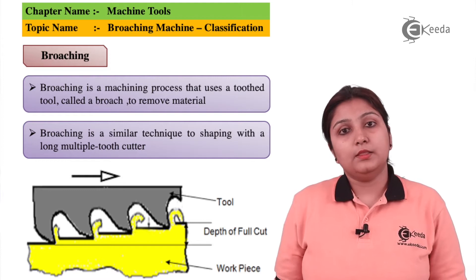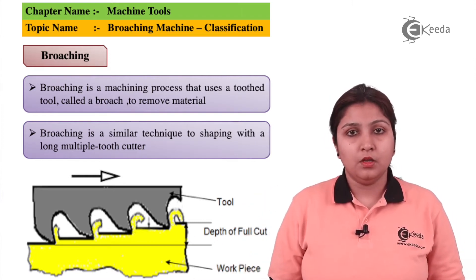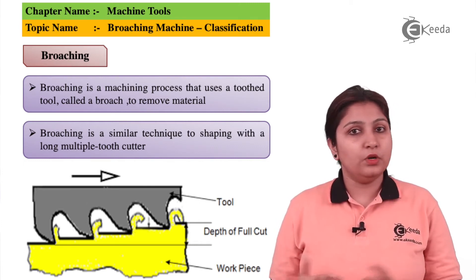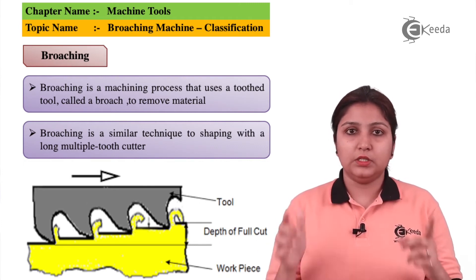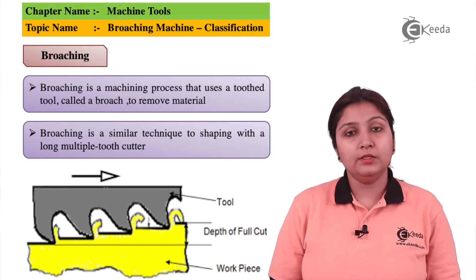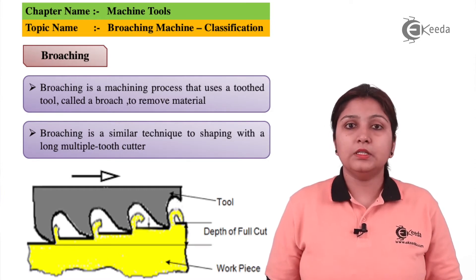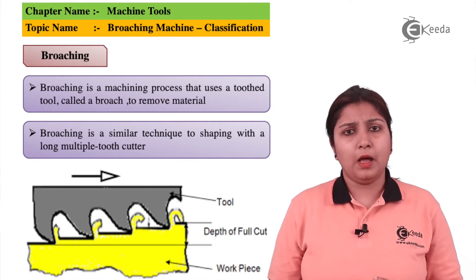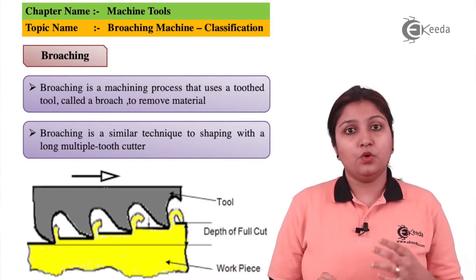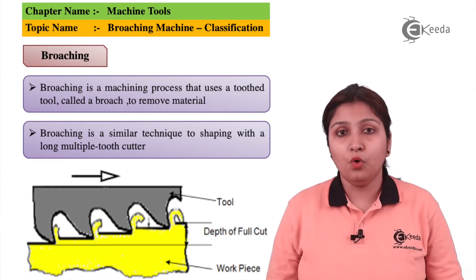In this diagram we can see there is a broach tool which has some number of teeth. A broach tool, if it is a single tool, is in the form of a normal tool. If it is a larger size, it has some kind of roundness and teeth on its surface. Some teeth are normal roughing teeth, some are semi-finishing teeth, and the other teeth are finishing teeth. In this way the broaching tool is inserted in a hole.